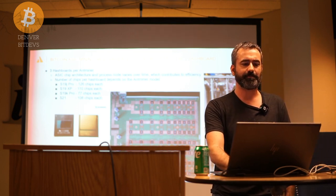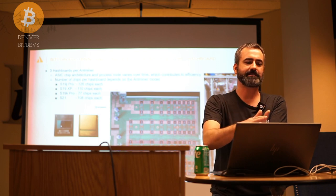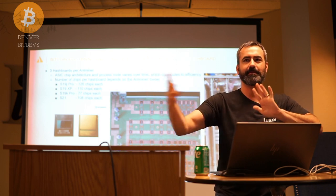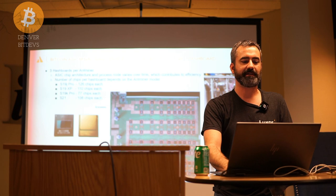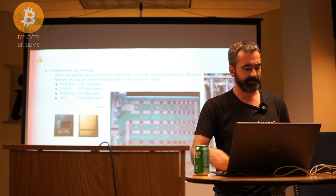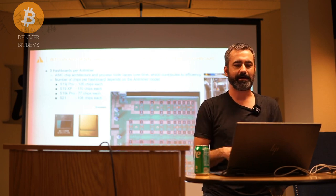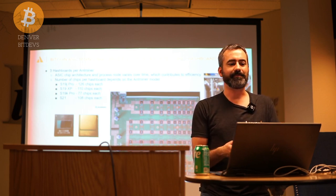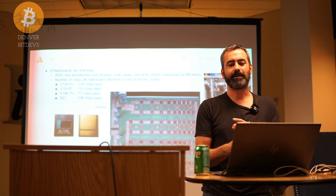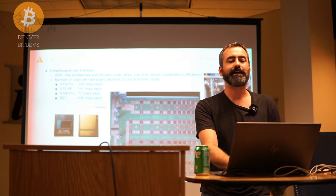So this is a close-up of the chip. This is the top, the actual die package that's going to have conductive thermal grease that pairs up with the heat sink to conduct that heat. This is the bottom side, so it's got these big pads for power, and it's got all these pins on the sides. That's all of its electrical interface, all that stuff that goes ultimately out to the ribbon cable and the control board. It's got a serial interface, power, ground, discrete signals. I don't know what else is there. We don't have any data sheets for these. These are Chinese made. There's no data sheet that says here is the pinout. All of this stuff has been reverse engineered and figured out by people.